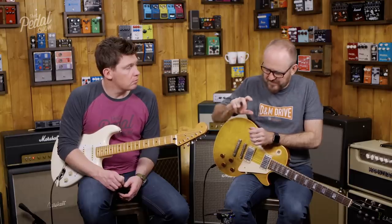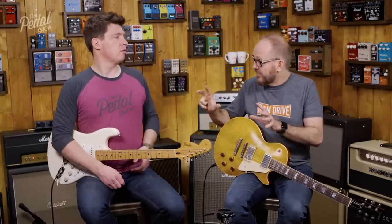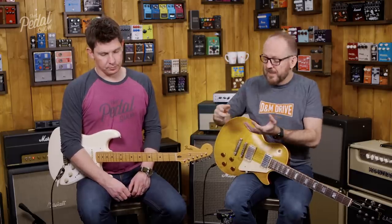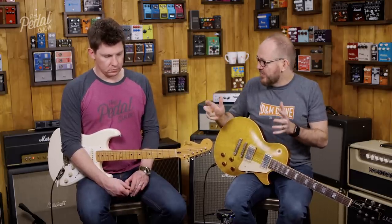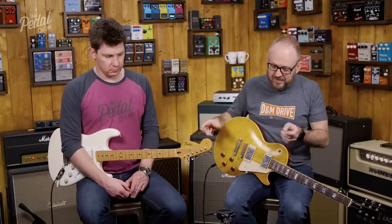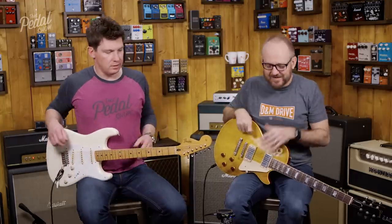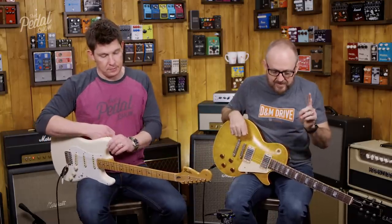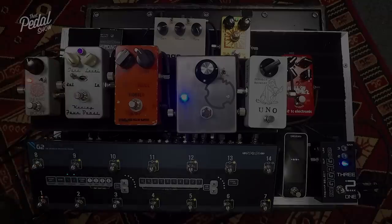You know, if you have the boost cranked and the fuzz low, then you might want to put the fuzz first. Yep. Or vice versa. They're both germanium transistors. They both have that issue with impedance, and no matter which one you put after, it's going to be seeing, you know, a low impedance at the input. So there's a compromise. It's down to you. Exactly. Yeah, sure. But the Beano on its own into the Marshall.